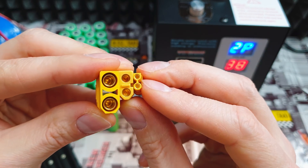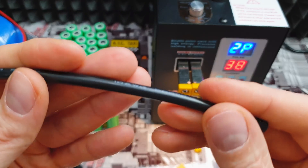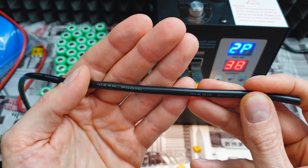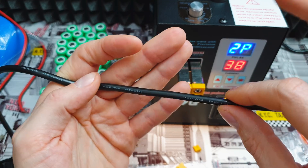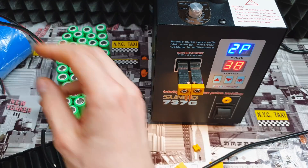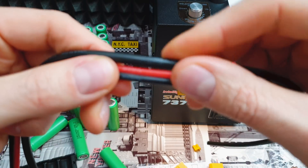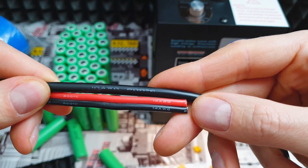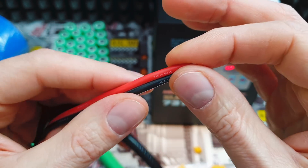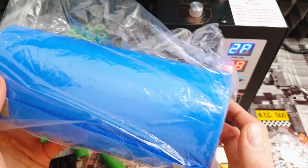I also have an XT90 here — it looks like a giant compared to the XT30. And the same people say use a huge cable like 10 or 12AWG because only that can survive the current. Honestly, I use that kind of cable in my electric skateboard where I need to pass more than 120 amps at 50 volts. For a scooter doing maybe 20 amps at 40 volts, I recommend a smaller cable like 14AWG. The size difference is huge. You could even use 16AWG — it just needs to pass not more than 15 amps at 40 volts.